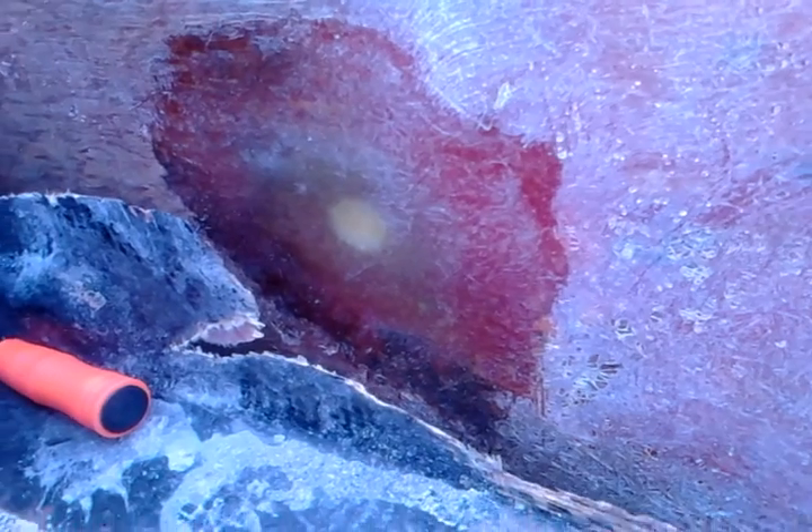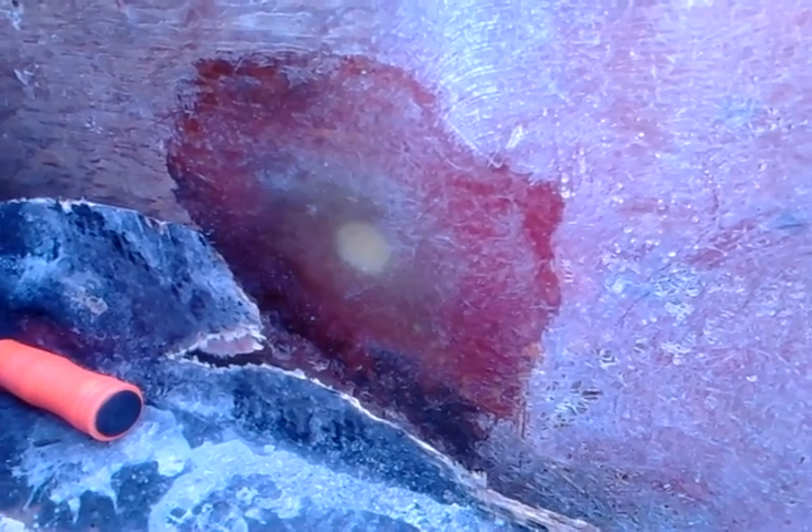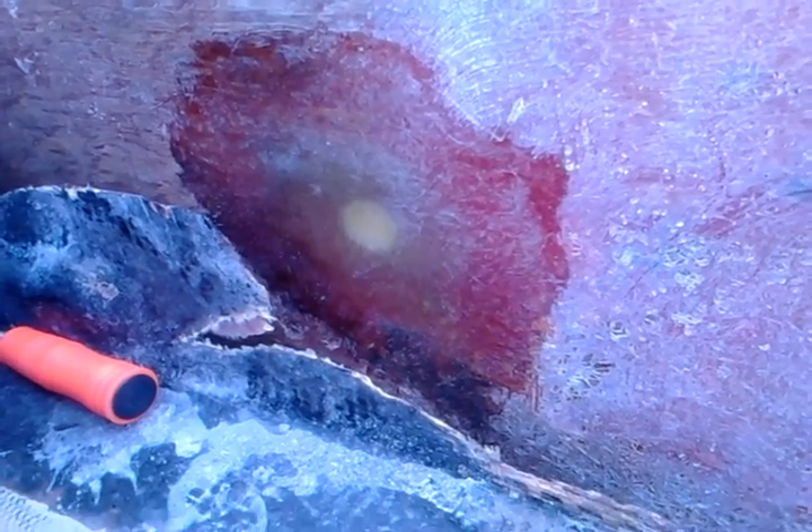It stays a little tacky. You add the wax for a tack-free finish, so you've got to grind that stuff off. It's just good practice to rough up and expose the glass.